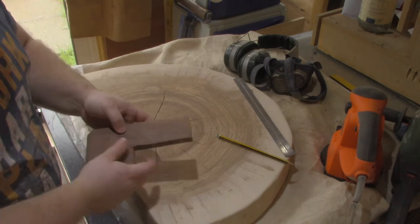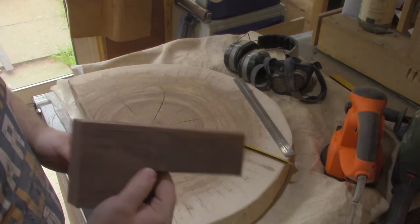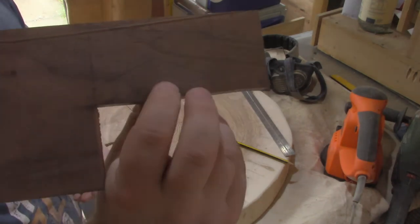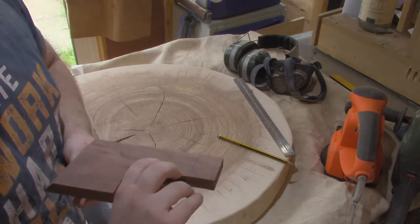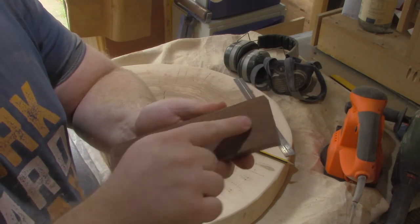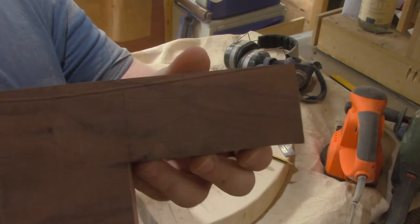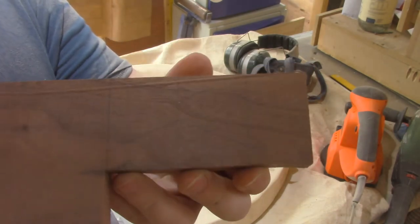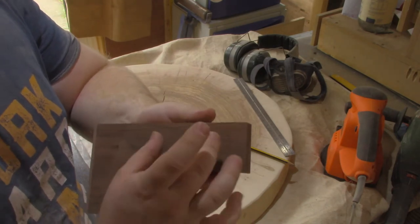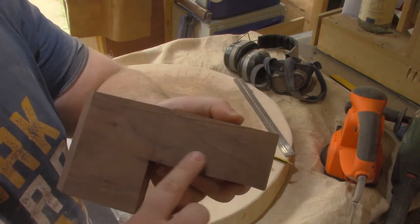So what we can do is put in some bow ties — they're really simple. I've got a piece of walnut here and all you do is measure out and draw a bow tie. The first thing you need to make sure is that the grain of the wood is going this way across the bow tie. If the grain was going the other way it's very easy for it to snap, so you want the grain to be coming this way of your bow tie.